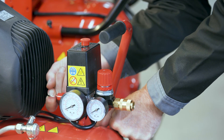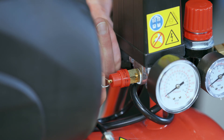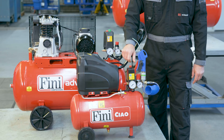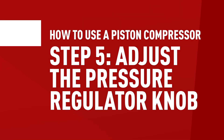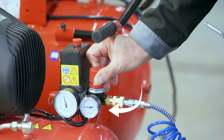I'll show you how it's done. The safety valve is usually a plug near the hose and it has a ring on it to make it easy to pull. Pull it and listen for a hiss of air. Then push the valve back in place before starting the compressor. Turn on the compressor and let it pressurize. The pressure switch will stop the compressor automatically when the maximum pressure is reached. Twist the pressure regulator knob and watch the smaller pressure gauge located on the hose until it shows that the pressure is at your desired level. Once the pressurized air is in the hose, you're ready to go.